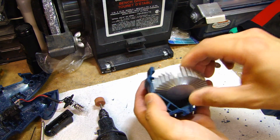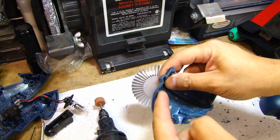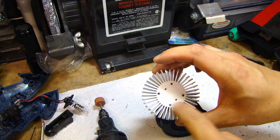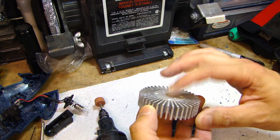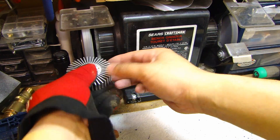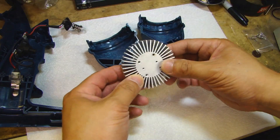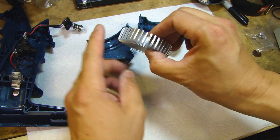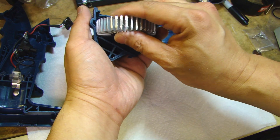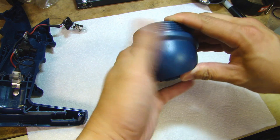The heat sink is a very snug fit and it's actually curving down this way. So I'm going to use the bench grinder and just grind it down at an angle. The screw hole facing the LED module will be on top, so I'll grind it down and angle it a little more. After all the grinding, you can see the edge is tapered toward the bottom — now it fits in nicely and the other half closes on it.